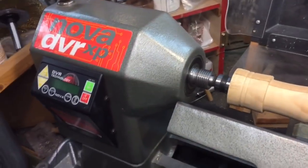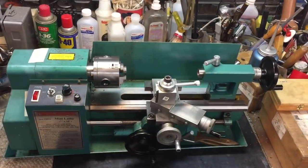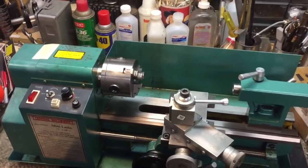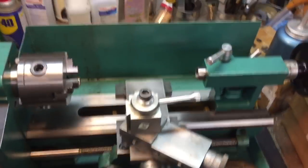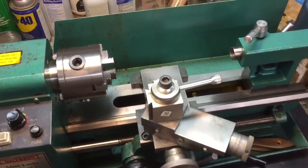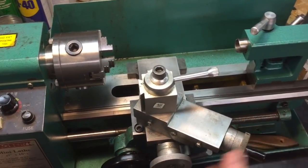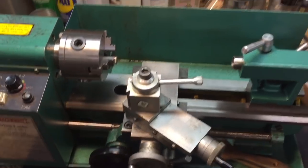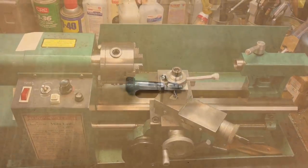There are many different types and they run into the many thousands of dollars. The second type of lathe is a metal lathe. A metal lathe is just like the wood lathe — it turns material on its side and still has a tailstock and a headstock. But instead of feeding the tool in on a tool rest, it uses knobs that feed the cutter into the work, and it's much more rigid — that's what makes it able to cut metal.